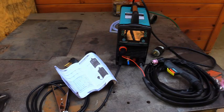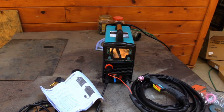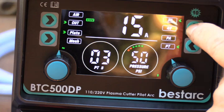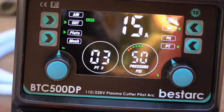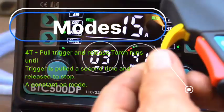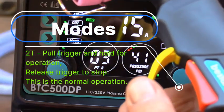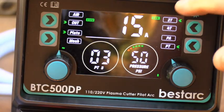We're ready to plug it in and turn it on. Power switch is in the back — it comes on, there we go. Right over here we have 2T / 4T. 2T means press the torch switch to start and release to stop. For 4T, you hit the switch and it stays on until you hit the switch again to stop it. They've also got this little wire here to give you the right gap distance on the torch. We'll leave it on 2T, which is your normal setting.